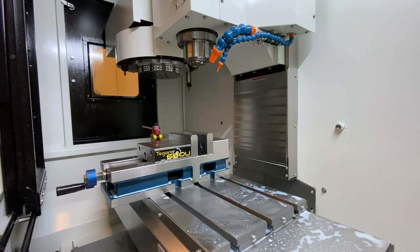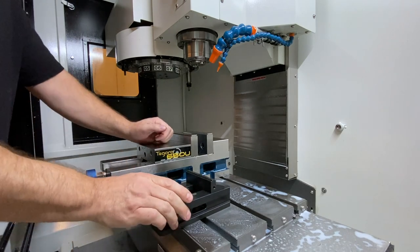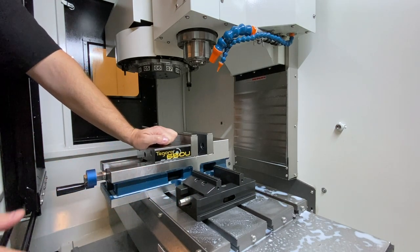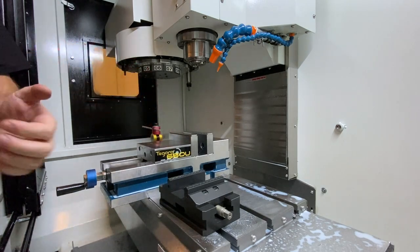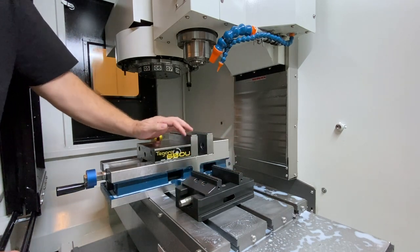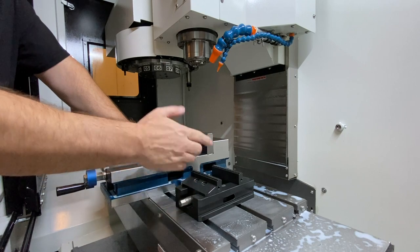Stepping down from something like a large vise, here's another vise I got from M-Lock. This is one of their 5-axis vises, and this is something you probably aren't likely to use very much on a little 3-axis mill. But on something like this X7, this thing could be really useful — you could stagger them and probably run 4 of these inside the work envelope, which would be quite effective. More often than not, these self-centering vises are used in 5-axis workholding applications. They're really good for operation 1, though many times when you torque them down, they're not nearly as repeatable as something like a fixed-jaw vise.